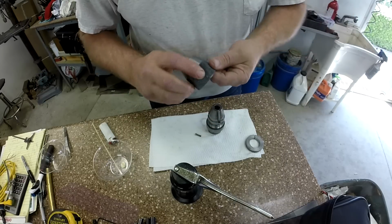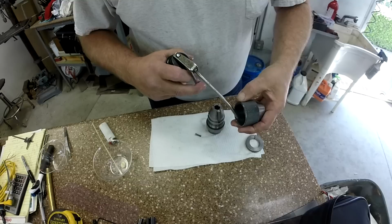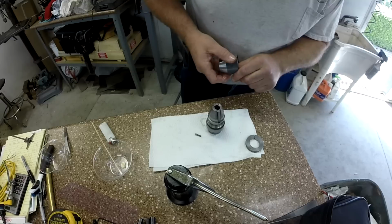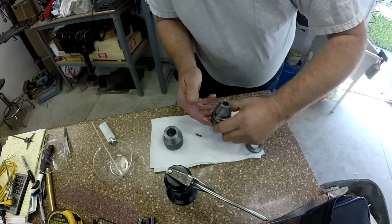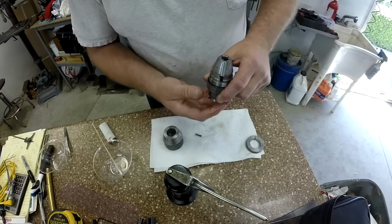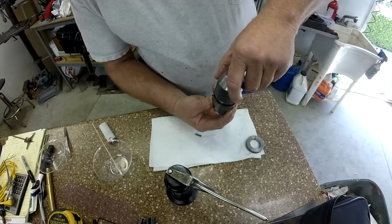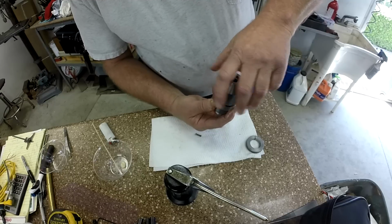We're going to coat the inside of our bell housing, or whatever you want to call that thing. Make sure there's a drop of oil on the threads. I tell you, the craftsmanship on these Albrechts is just amazing. The fits and everything's like a suction cup in there. All right, when you lift back up, you need to make sure you landed in your roll pin groove there, and make sure all 3 jaws are in tight. And this is a standard thread. And you just turn it backwards so you can feel it drop in, and then spin it on.